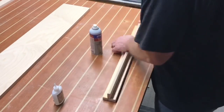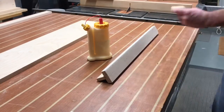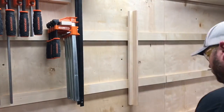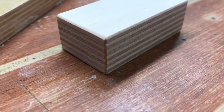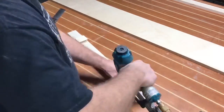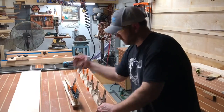This next clamp storage solution I think turned out pretty cool - simple as it is, I'm proud of this idea. You make a T-joint with some Baltic birch and attach the cleats on the back. Only attach one cleat first, because the piece is going to span two cleats on the wall. Use that as a reference, then brad nail in the second cleat. Even the backer piece gets hand-chamfered edges for that nice soft feel. These squeeze clamps look nice and organized, and you can take the entire rack with you if you need multiple clamps at once.